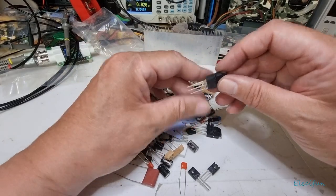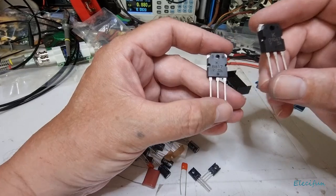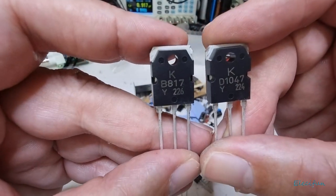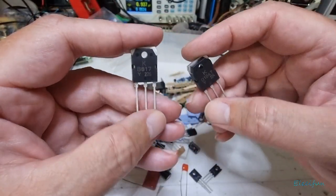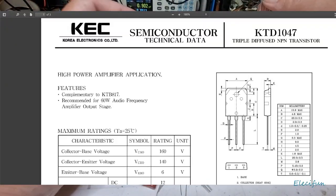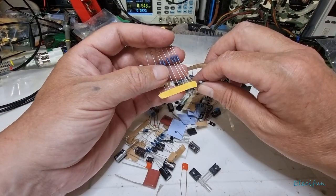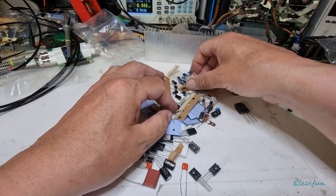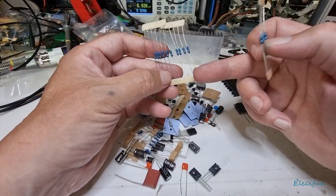There are all sorts of chips here. These are KTDs — Korean transistors. These are the main output chips, the 1047, which may look familiar but I don't think it's the same. I'll stick a reference up on screen for it. We've got a whole bunch of the same resistors, which is nice — at least for this board I can just do one value.